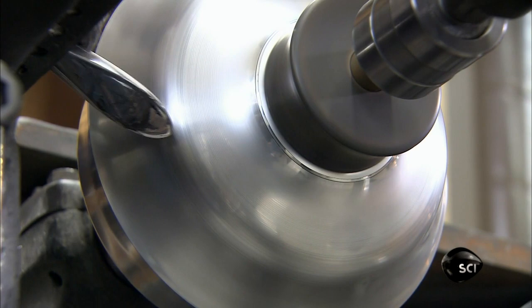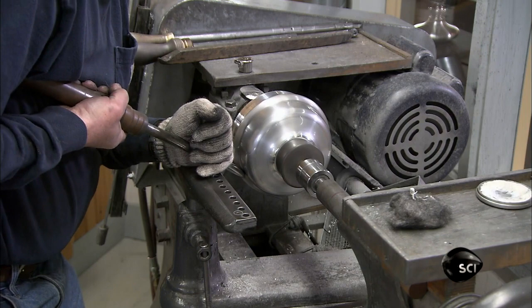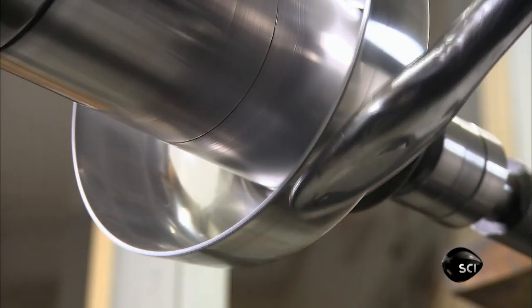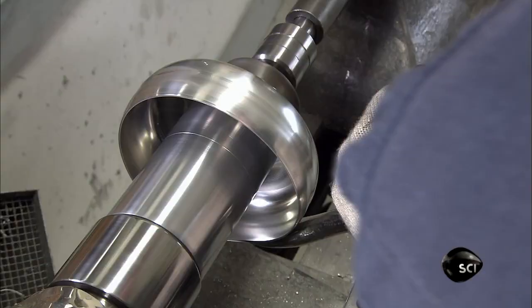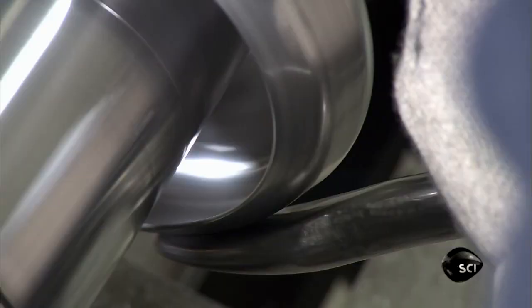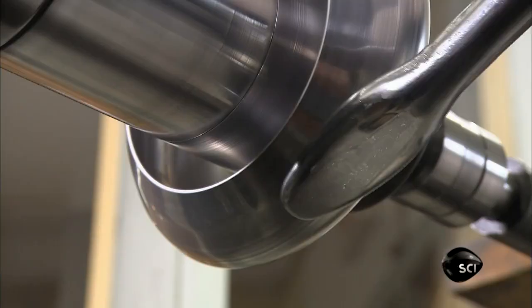This takes skill. If he works too fast or applies too much pressure, the pewter will become fatigued and break. This first spin produces a basic shape. In the next spin, he trims the edge. He also rounds the lower half of the reservoir using the spinner's finger, but this time he doesn't use a template. Instead, he works freestyle to match the contours of the lower half to the upper one.